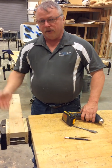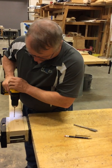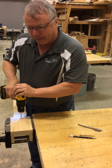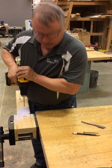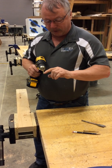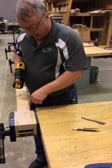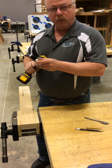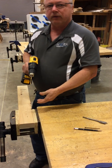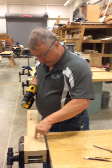If you're drilling a hole and you're going down but not going all the way through, here's what you don't want to have happen: you drill down, stop, put it in reverse, and back it out. What happens is all of the sawdust — the chips that were in the spiral — you just pushed those right back down into the bottom of the hole. So if you were trying to drill a one-inch hole, you drill down, put it in reverse and back out, you may only have a 15/16-inch hole because all the debris that was in the shank is now down in there.